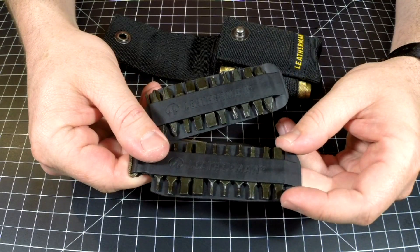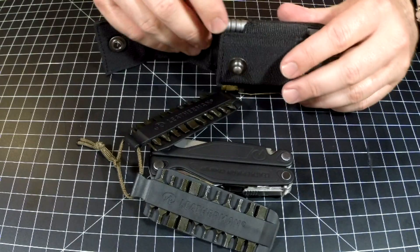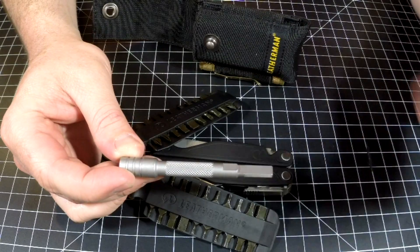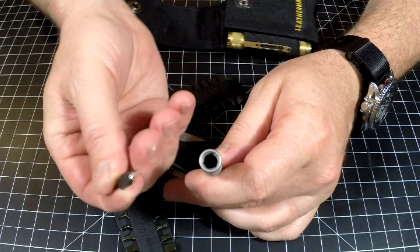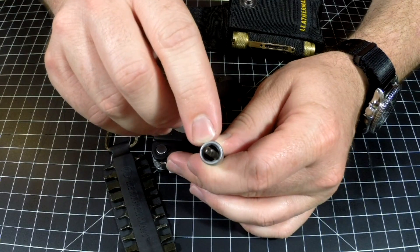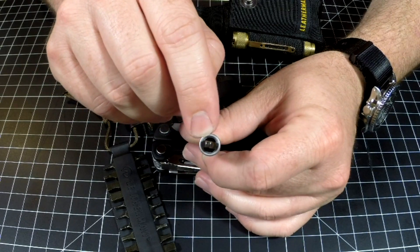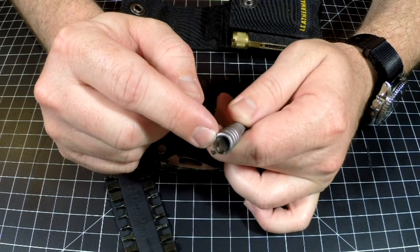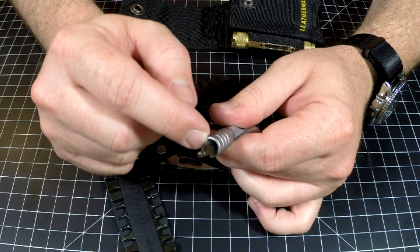Are these bits as strong as some of your other hex bits? No, I don't think they are. I also have the bit extender on the other side of this little pouch — it fits like a glove, like it was made for it. But if you put these 2D bits in a bit extender, you don't get a full wrap around; there's airspace on the big flat portions on both sides. So you're not going to get as much purchase all the way around the bit, and you could theoretically strip or chip these edges off if you put a lot of pressure on it.